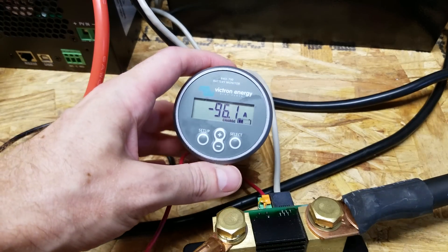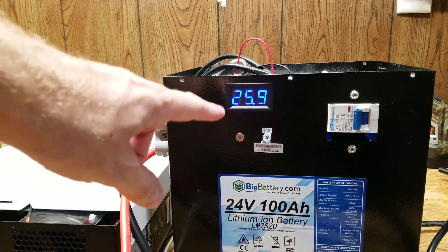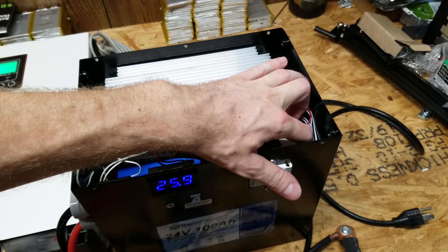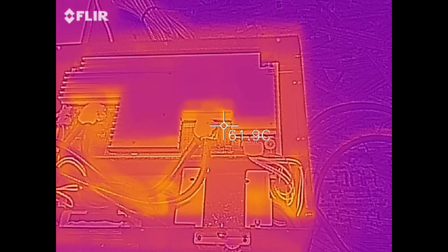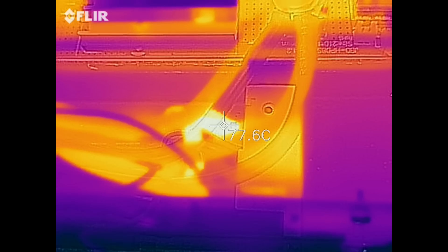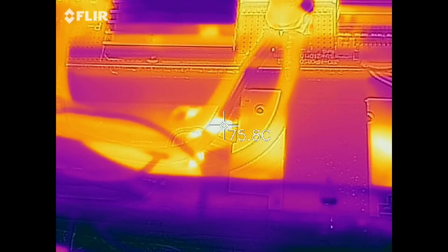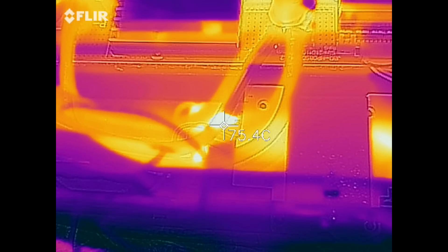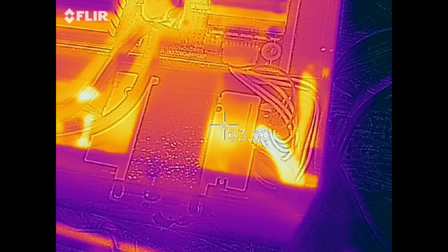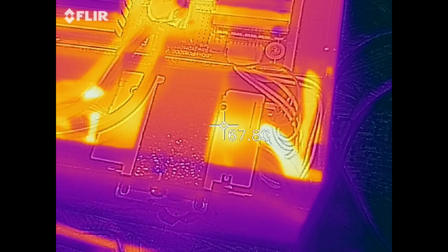It's been exactly 15 minutes since I started this test and we are still pulling 96 amps. The current is slowly increasing as the voltage in the battery decreases. The battery is currently sitting at 25.9 volts. Generally feeling inside the enclosure, the breaker does feel rather warm. We are now 18 minutes into the test — this is the point at which the thing shut off last time. With the thermal camera, I see a hot point sitting around 77 degrees Celsius on the 6 gauge wire that comes off the breaker. The input side — a pair of number 8 wires — is sitting around the same temperature. The area of the breaker that hit 150 Celsius before is currently sitting at 67 to 68 degrees Celsius — that is definitely a substantial improvement, more than half the temperature of before.